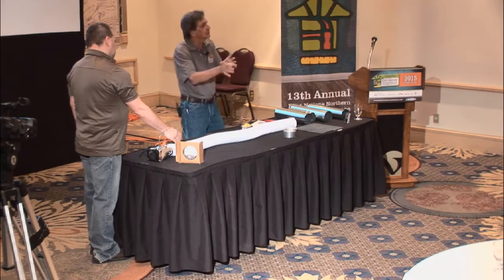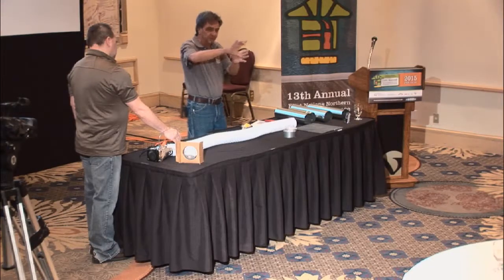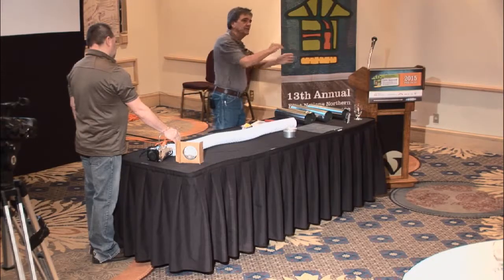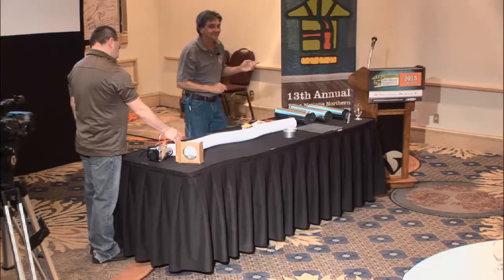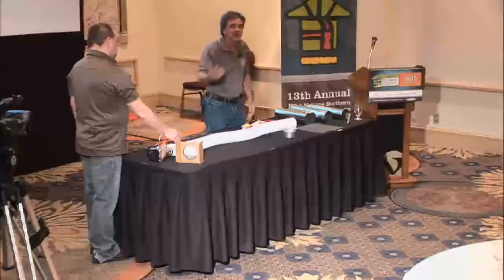Because what happens when you go out the soffit? I know in Ontario they allow this. They don't allow it in all of Canada. Ontario is kind of a strange province. They allow all kinds of garbage. But when you go out the soffit, the hot air turns around and goes right back up the soffit and into the attic. Okay? So it goes out the soffit. Theoretically, you're supposed to block the soffit for 3 feet on each side so the wind will blow the stuff away before it can get into the attic. Well, didn't we put the soffits there to ventilate the attic to stop the ice dams? Okay, so now we're blocking it up to get this stupid thing going out there.